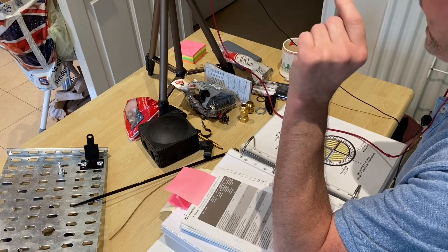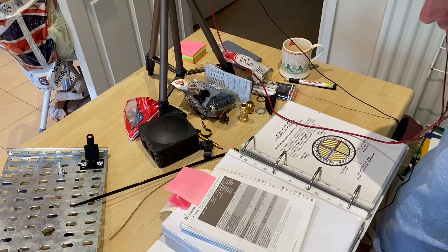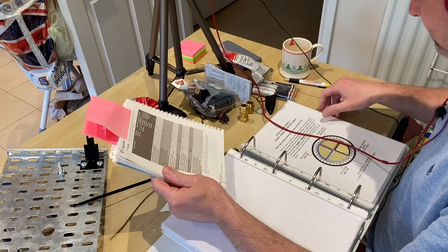Stick a highlighter pen on 5.8 and 3.5 - really important. Note that on a caravan park under special locations it bumps up to 6m, but we'll cover that in the special locations section. For now default back to: catenary wire with steel armoured on it - 5.8m where there's traffic, 3.5m where there's no traffic. Catenary wire is very common in the electrical industry.